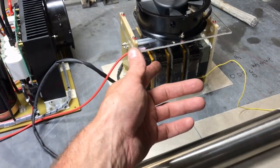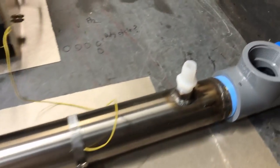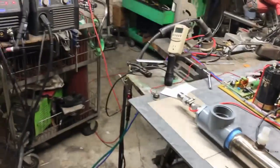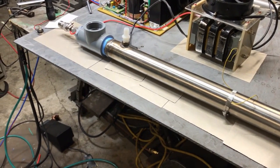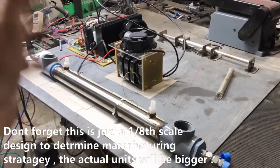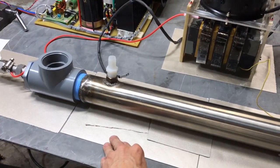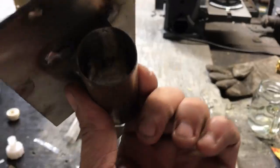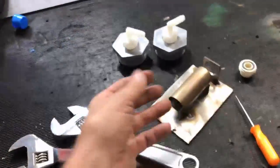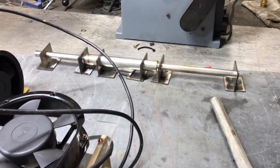Sometimes you can just circulate the oil to a ground tank. What I'm going to do now is tighten everything up, hook the circulation system up to it, and then hook the oxygen concentrator up to it. We'll do another food coloring test where we take a jar and pump the ozone into it. I'm actually going to do that in a separate video Juan - I just wanted to get something out to you to let you know that the cell is done. I've got the gap to where we don't have lightning bolts that are super big.